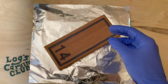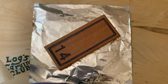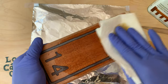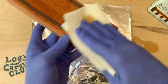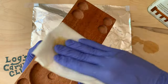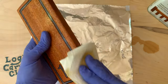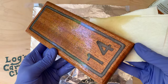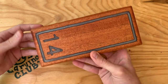So now we can finish the wood. I'll be using this teak oil finish, but any finish should probably be fine here. I think this one's got some nasty fumes, so I'm wearing all my PPE. I normally use either mineral oil or a mixture of mineral oil and beeswax, but I like this finish since it waterproofs the wood pretty well. Also, I don't need a stain since I'm using wood that I think looks good on its own. This is always one of my favorite steps when you can finally see the finished color. Follow the instructions on your finish, because this one took a couple days to dry.